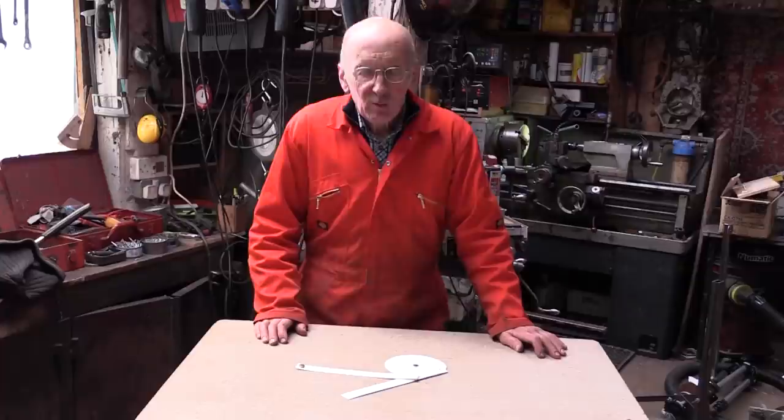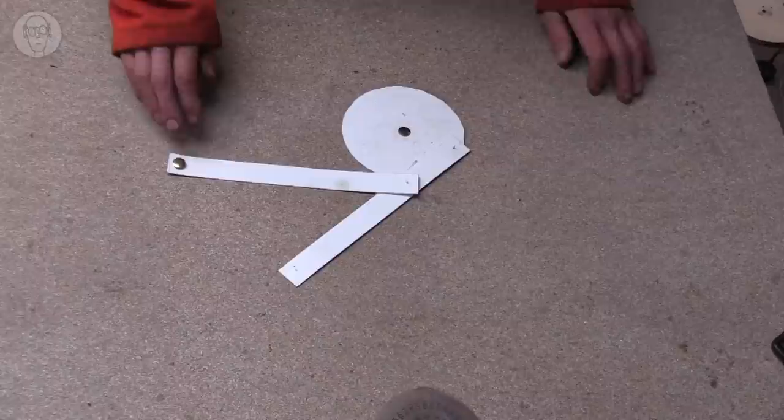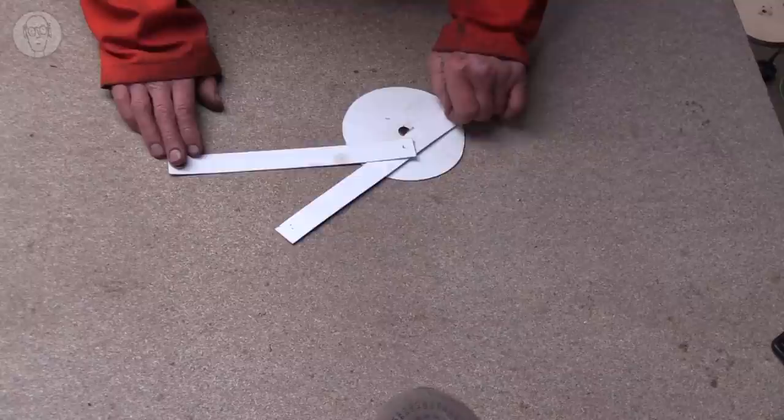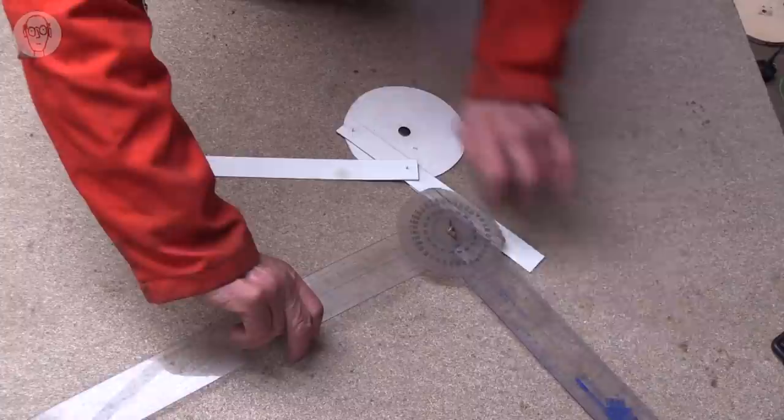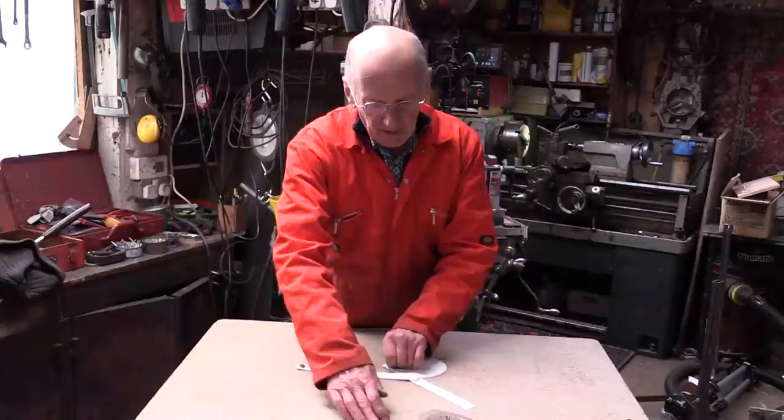One motion that I often seem to need on my machines is to flip a scene or part of a scene round by 180 degrees. And you can't do that with a simple crank. The maximum angle you can get is surprisingly small. I was just measuring it. It's about 110 or 120 absolute maximum. So if you want a 180 degree turn, you've got to do something different.